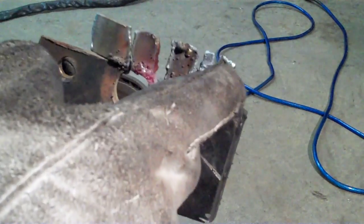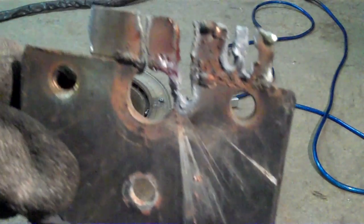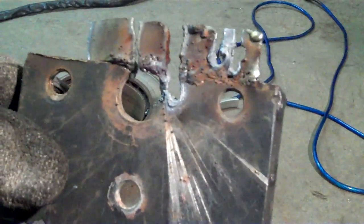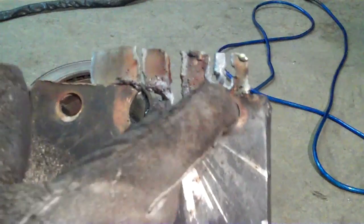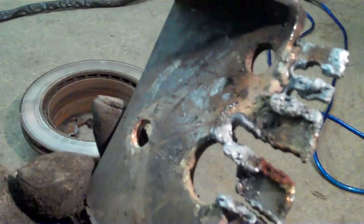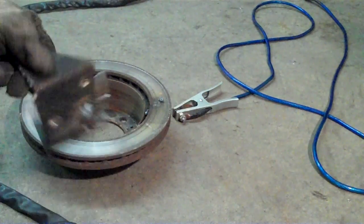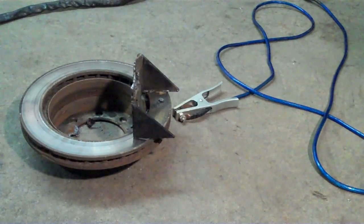It just got up and boogieing. I cut down here, cut down there, and then cut down into the thicker material, 1/4 inch, and it just got going. So I wish I knew what the difference was. I wish I knew what the deal was. See, and look at the arc that just comes out. Interesting. See, look at all the blobs and all the globbing that's present here, and I know that that's not supposed to be the case. I think probably a lot of that's just going to bust off, probably just slag or whatever, but anyway, I'd sure like to have this work consistently with success.